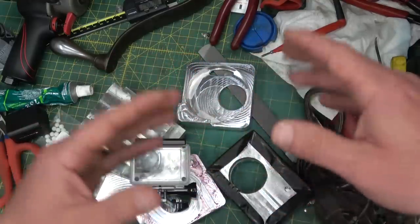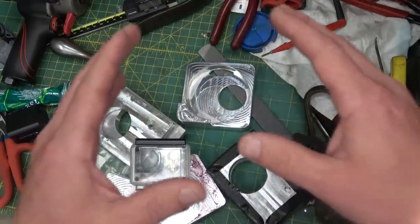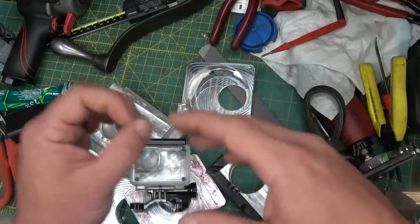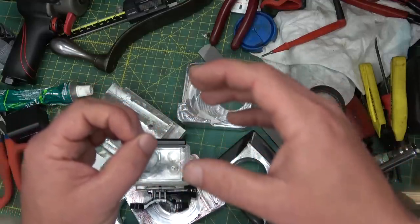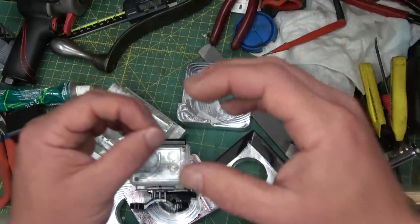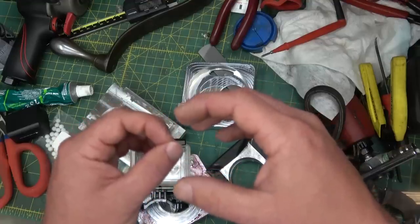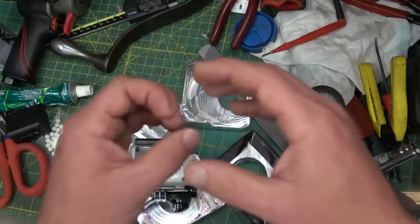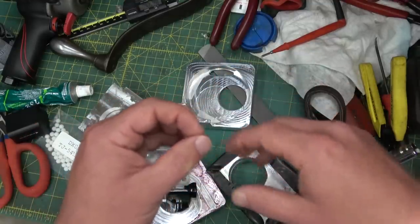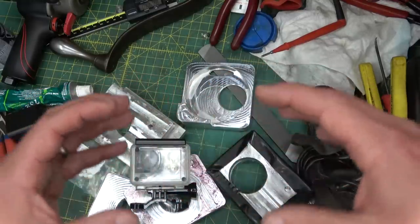The water actually doesn't want to interact with the glass because of its high surface tension. But if there's some dirt or schmoo on there, the water wets the glass and sticks on there like glue. Starting with high surface tension polar water — it will not mix with oils, hydrocarbons, or any non-polar compound. We add an ester to that — that's the coolant you pour in — which is only very slightly polar. That allows the water to interact with hydrocarbons and reduces its surface tension, helping it carry away heat better and lubricate better because it gets into the nooks and crannies.